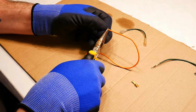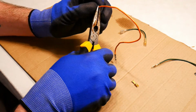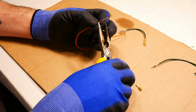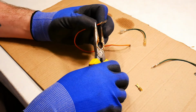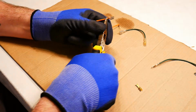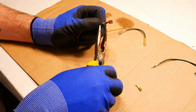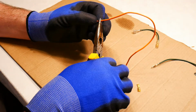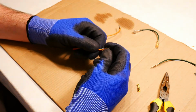the connection, and now I'm going to press down that flap and give it a good press. So it's going to grip the insulator. So that's its role. And then on the other side, we're going to do the exact same with the second flap at the rear. We're just going to fold it down, press it in at the side first, and then we're going to press down on that good and tight. Make sure that that is nicely gripping my insulator. I'm going to go back to the other side, and I'm just going to press on it again from this side. Good pressure. And now my electrical connection has gripped onto the insulator.